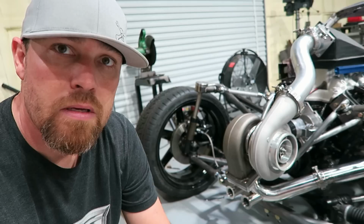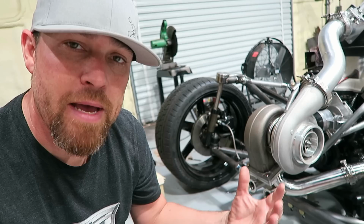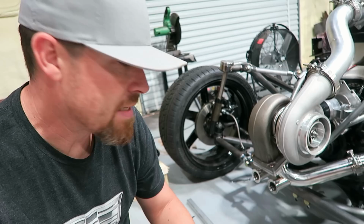So the plans are to finish weld these off the car. And I just drilled those holes in those tubes so I'd have gas coverage from the inside, because I'm gonna have to back purge everything when I weld it. I'll just plug off these outer sections, and then that argon can flow everywhere it needs to flow to get those welds covered on the backside.